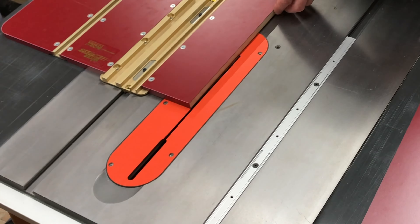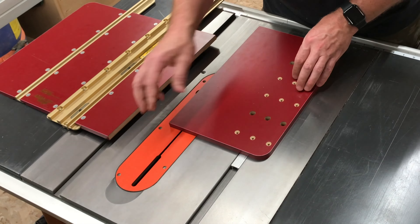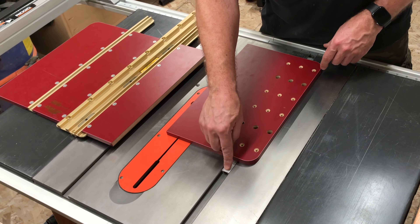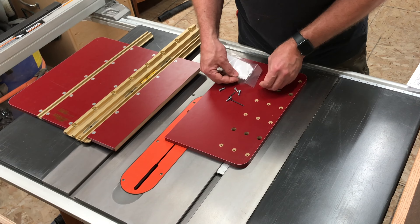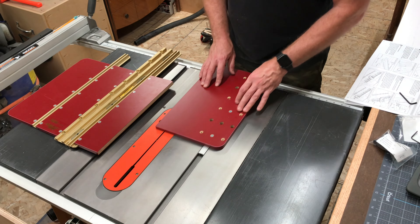We'll find the pre-drilled holes. I'd like to use this one, but it doesn't actually cross the blade, so we're going to have to move it over to this slot — that way it's the least amount of trim off the drop panel. You'll notice there are access holes for the miter bar, so if you don't like the fit you can make adjustments right through the panel. We're going to use these four longer screws to attach this panel to the miter bar, then raise the blade back up and trim off the rest of this panel.